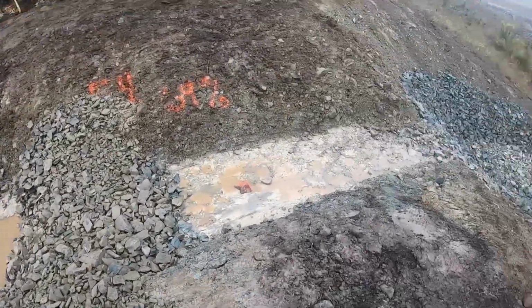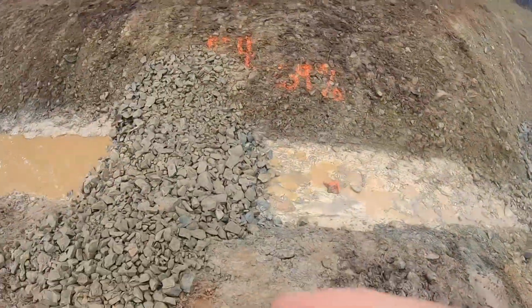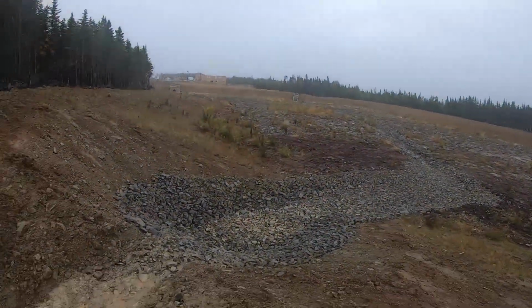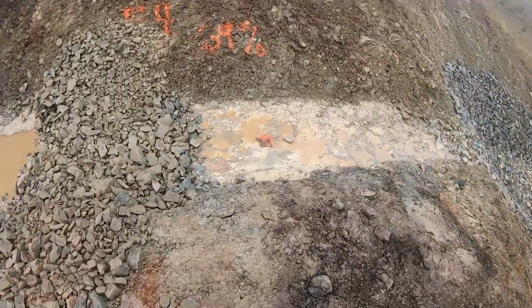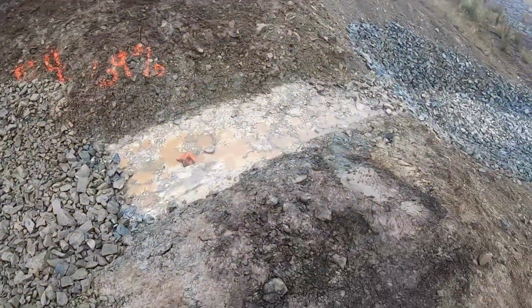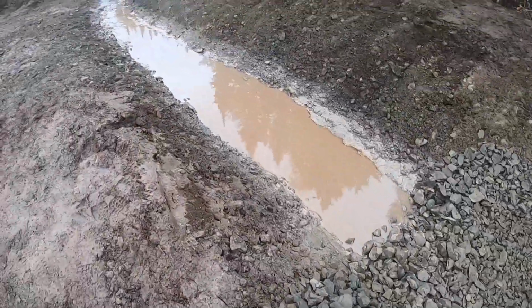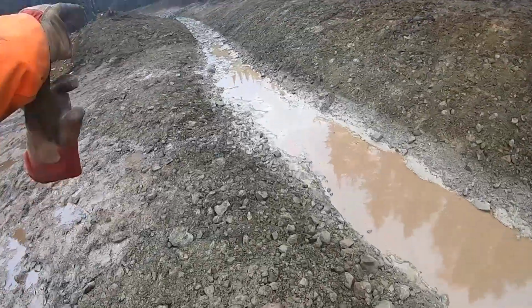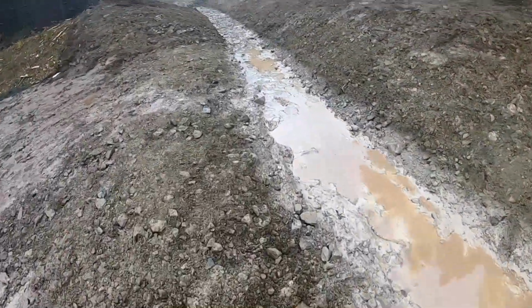Sediment filter. By the time it gets over there to what they call the head wall, once it filters down through here and filters all the way out through the rock, all the way up through and gets to there, it should be fairly much clean. And the majority of that there is not too bad. There's still sediment getting through it though. But that's probably what's coming in from right here. It hasn't been here long enough to get a chance to wash itself right down through, because all this sediment that's here, that'll eventually wash and be caught through those blankets, those screens.